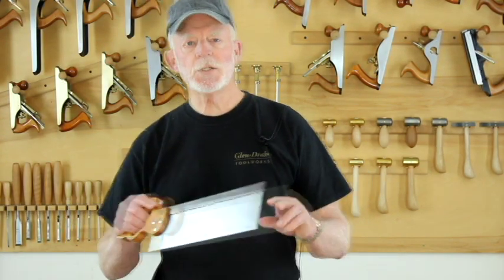I'm a big fan of working as relaxed as possible. We simply cannot move fluidly if we are rigid and tense. Most Japanese saws and some Western saws have a straight handle, but most Western saws have a pistol grip handle. Unfortunately, a pistol grip locks your wrist into one position, forcing you to tension your body as you work, whereas a straight-handled saw allows you to change that angle so that you can relax as much as possible. I therefore prefer a saw with a straight handle.